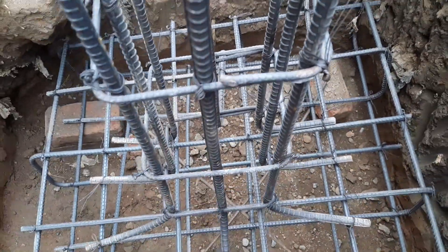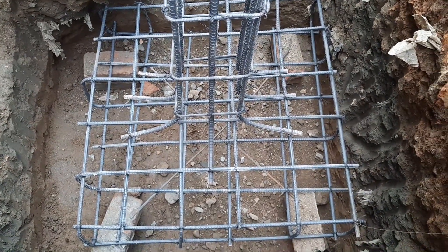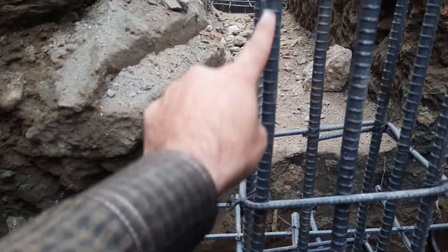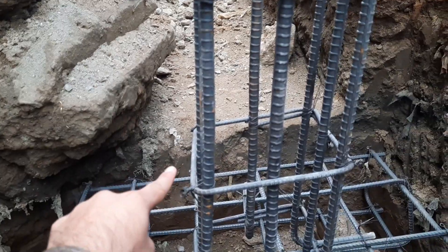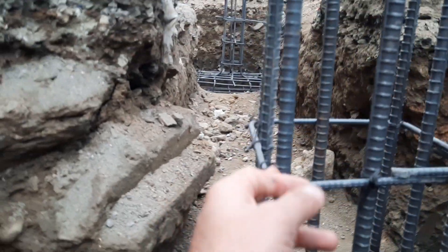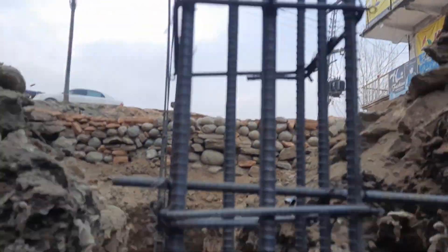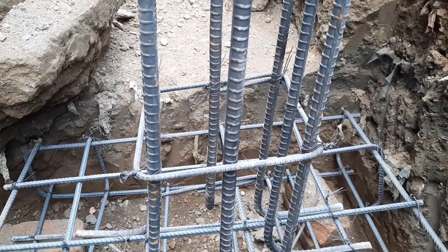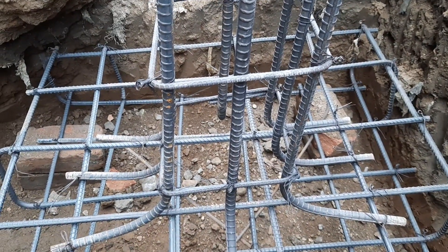The hooks are bent at 90 degrees — the correct way is to provide them at 135 degrees. The spacing is inconsistent: about eight inches in one place and ten inches in the next, so they are not following the proper design for this column, especially at the stirrups. Near the floor, the spacing of stirrups should be close together, not more than six inches, because this is a commercial building.